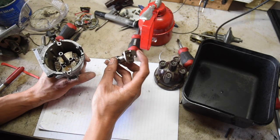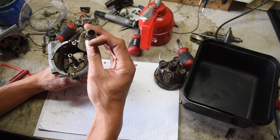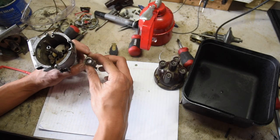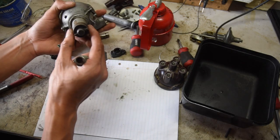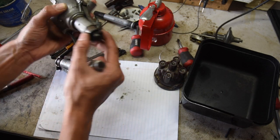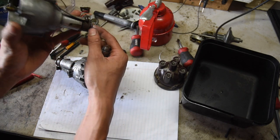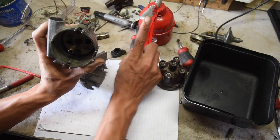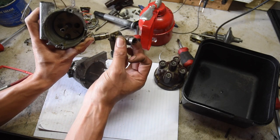Now these two pins will go into there, but they will go in both ways. The way you find out which way they go in is: when this piece here — this cutout where this piece slots into — must be facing the 6 o'clock position. If you look on the bottom of this, you can see how it's slightly offset. So when this opening is at the 6 o'clock position, the pin driving dog should be on the right-hand side viewed from the top, before we hook the springs back in.